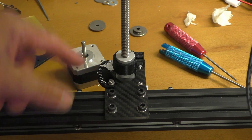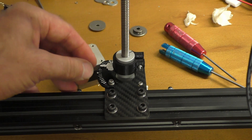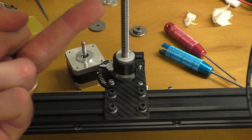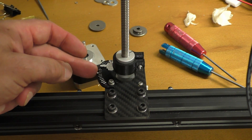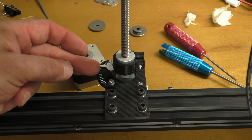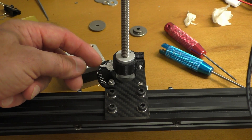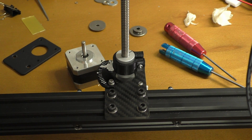These are just pointers. As the stepper motors, when they're unpowered, you can easily knock them. And this is just a finger pointer like this on a scale, so it's quite easy to see if you accidentally knocked your stepper motor out of alignment. If you move this even a fraction of a degree, it's going to upset the level of the bed.